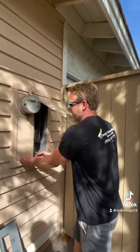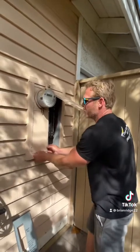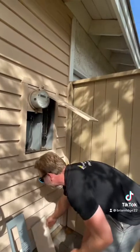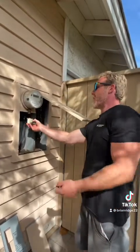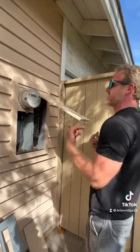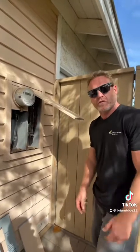From the backside in the garage where there's drywall, I'll cut the drywall so I can land all the wires into the back of the new panel. Edison already removed the lock on the meter, so I can pull the meter, remove all the breakers and wires, get this panel out, then install the new panel and reinstall all the wires.